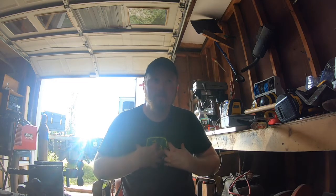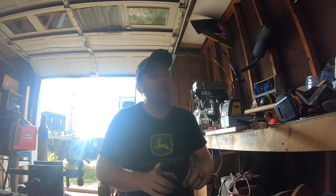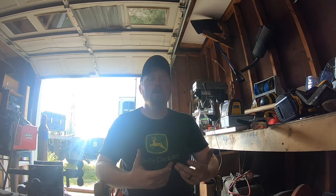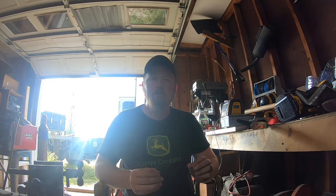Usually on that kind of thing, I tell everyone it's hard for me to guarantee, especially with cast metals. Guys out there who have done it more might know more, but from my experience level, I can't guarantee cast metal will always hold. I will weld it once. You can obviously pay me, and if something happens and it breaks again or cracks within a few weeks, we'll weld it again. If it happens again, you really need to look at just replacing that part, because the metal's just worn or it doesn't want to weld. Having said that, I've done probably at least a couple dozen cast iron jobs, and all of them have held up pretty good.